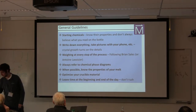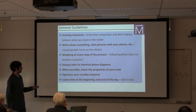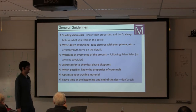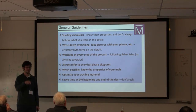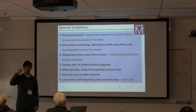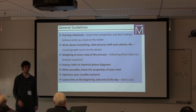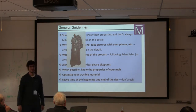It's extremely important to refer to the binary chemical phase diagrams. This can help you avoid some embarrassing situations. Keep in mind that these phase diagrams always have peaks and valleys, and if you combine two elements in just the right way, you may cause the melting temperature of your melt to go above what you can access in your furnace. Besides that, you want to think about how your melt might react with your crucible.